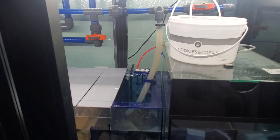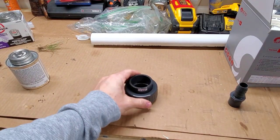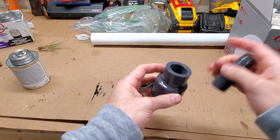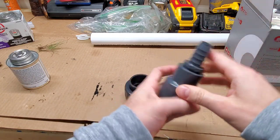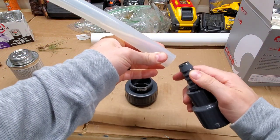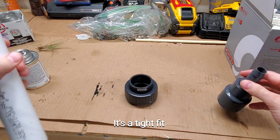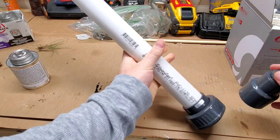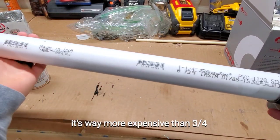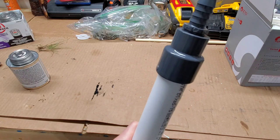I'll be back — give me a couple weeks to get the piece in. So as you can see, I need a one-and-a-quarter-inch pipe to go to this slip fitting, which takes it down to three-quarter inch where I can put a three-quarter-inch barb onto my silicone. I put it on just to test it out and I could not pull it out — so I'm not going to put it in until it's time. Got my one-and-a-quarter-inch PVC pipe from Lowe's — it was about three dollars for a two-foot section. I'll cut it down, glue it all in, and call it a day.